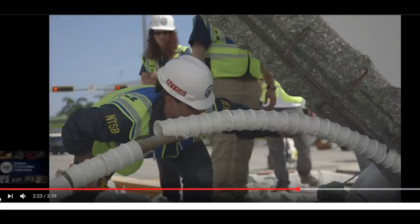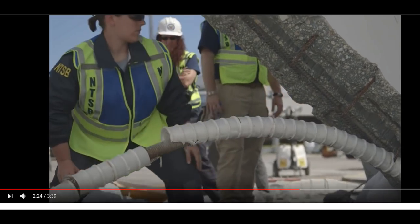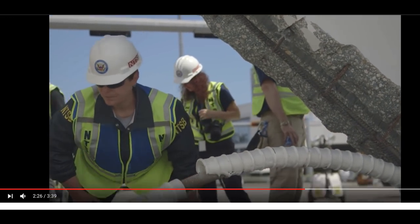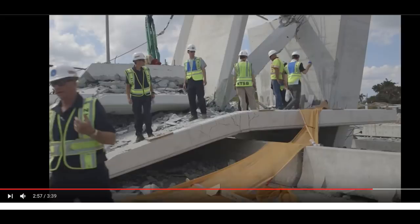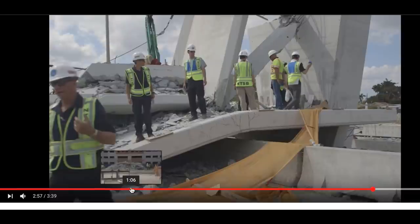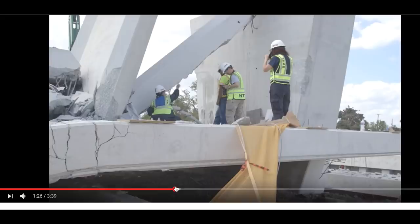With, mind you, one more factor that's going to create the buckling so much more easily. That's the failure under here. Let's see if I can find a better shot of that. That's the failure under there. All right. So that's the failure under here. If that reinforcement, the post-tensioning cables, is down here, so when you go to crank this column up, instead of it being in the middle and giving it an equal, fair, balanced compression, it's at the bottom half of this column.